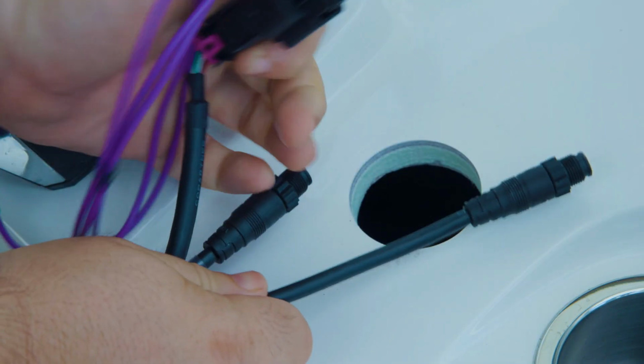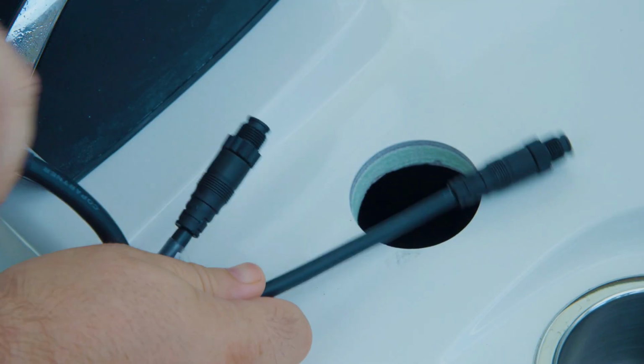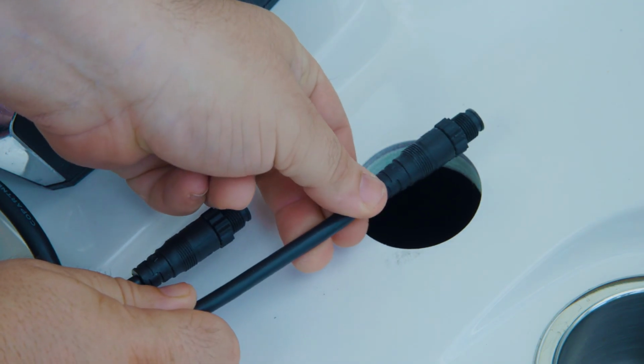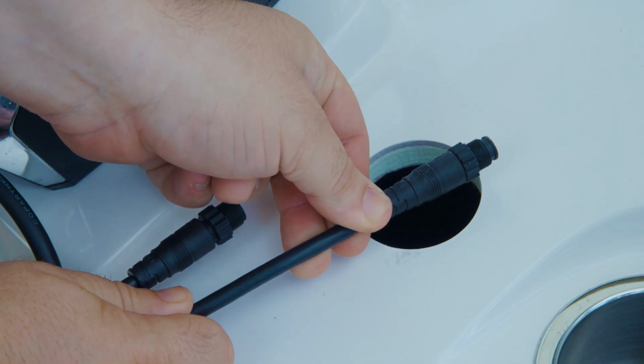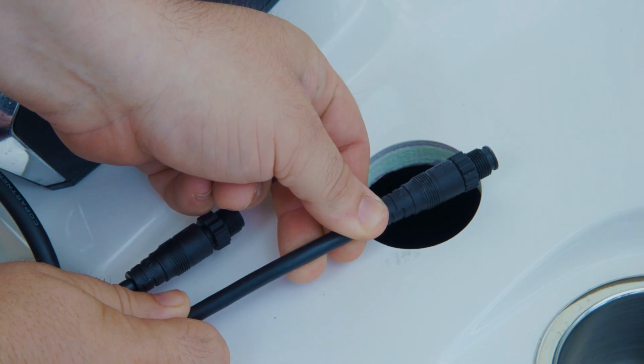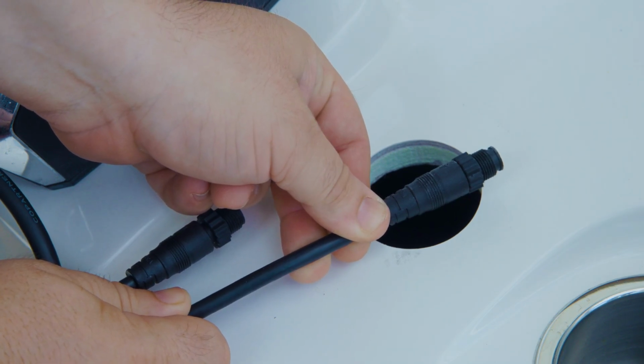Finally, the longest cable on the keypad is an NMEA 2000 connection. This cable should be connected using an additional micro-C drop cable and micro-CT connector into the vessel's global NMEA 2000 backbone. No other cables on the Pro Control Auto keypad should be connected into the vessel's global NMEA 2000 backbone.